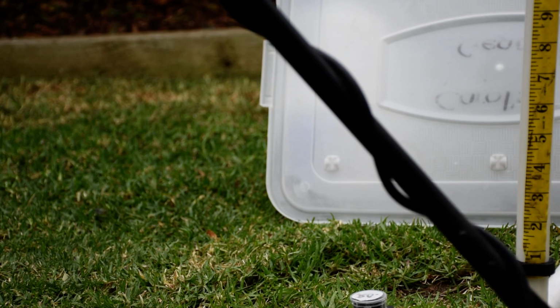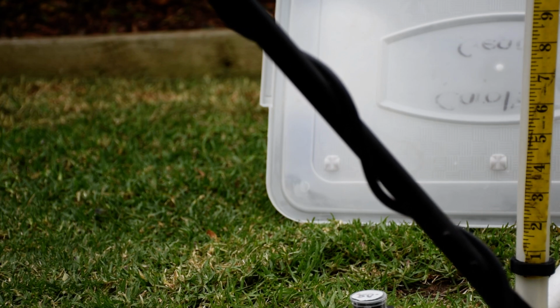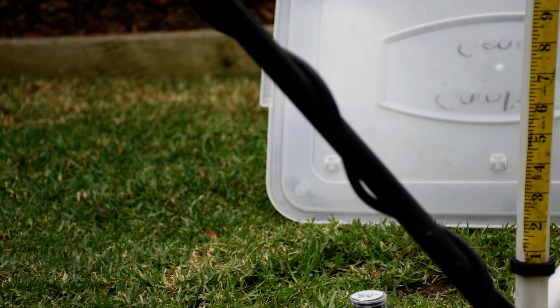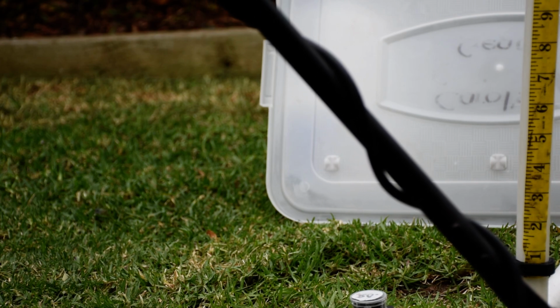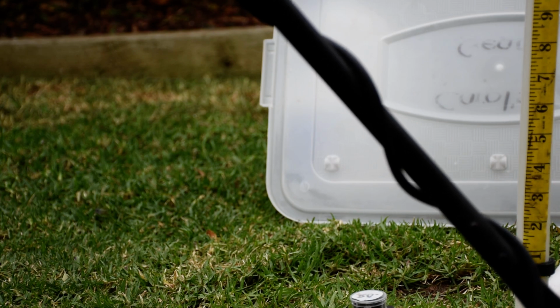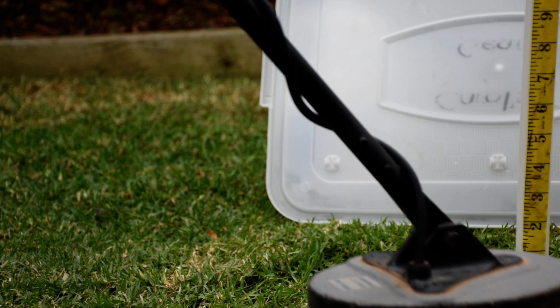Now of course you can increase threshold A up to about 70 or 80 and try and do the same. You'll get about the same depth, but you're going to introduce a lot of EMI, because the higher threshold A you've got, the more EMI you're going to introduce. So there we are, I'm at 80. I'm going to drop threshold B down, might only get 1 or 2. We've only got one there, below null.